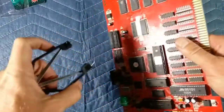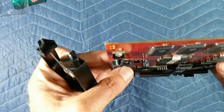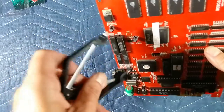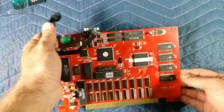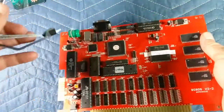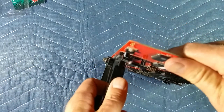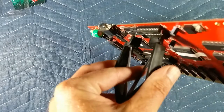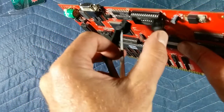You can see there's like a little notch under the chip you can grab. There's also a little notch in the socket, so you don't want to just reach in there, clamp on, and start tugging — because you'd be pulling on the socket, and we don't want to take the socket off unless you want to resolder it. You want to make sure when you clamp on, you're on the chip and not on the socket.